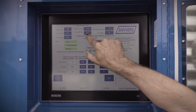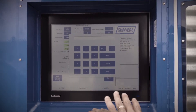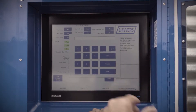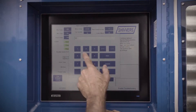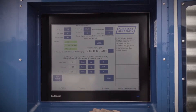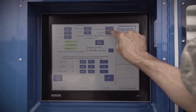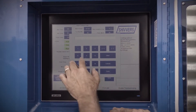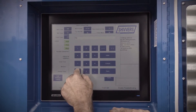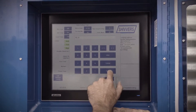Our fan shutdown time here in minutes — basically when this system runs out of grain, how long do we want that fan to run? Let's say we want the fan to run for 30 minutes. So at 30 minutes after we run out of grain, the fan is going to shut off so we don't have to manually come back out and turn the fan off. Our transfer moisture was set at 16%. Let's change that to 16.4, and then we're just going to save that.